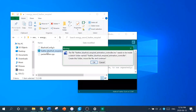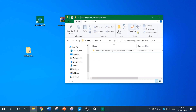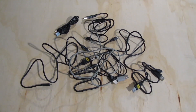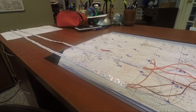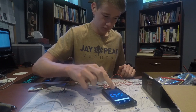It's not working? Well, that's because when you opened the project file you put it in a separate folder — put those files in a folder with the project file. Still no luck? That's because that's an electricity-only cable. We're transferring data — it doesn't matter that you have 10 of these cables, none of them are data cables, you need another one. Now that you have the right cable, turn on your circuit and upload your code. It should come to life. Still not working? Everyone knows that electricity only goes one way through LEDs and those arrows on the circuit diagram are just for decoration — you have to wire it correctly.